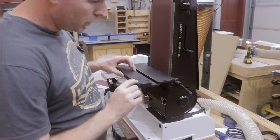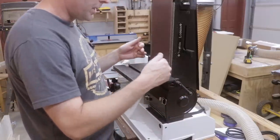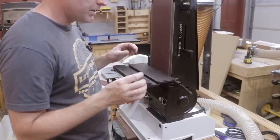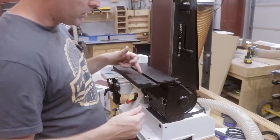The Jet fence looks like thick aluminum with some type of plastic insert. You've got the ability to adjust it to get the correct depth from the belt — you want about a sixteenth of an inch between the fence and the belt — and it also has a miter slot. The locking handles on the Jet are quite nice as well.